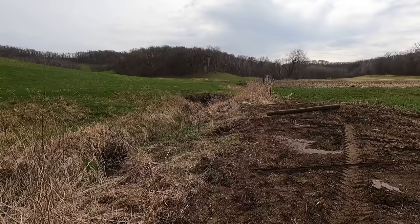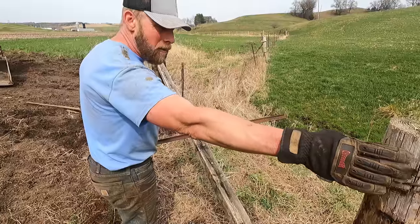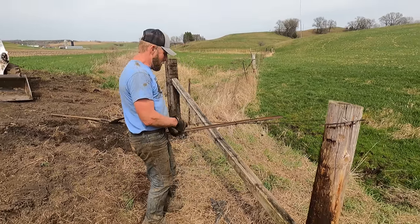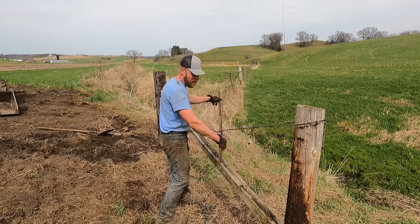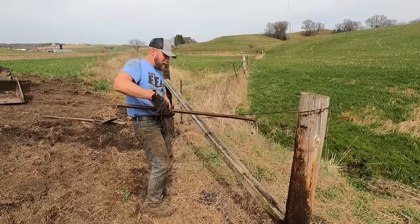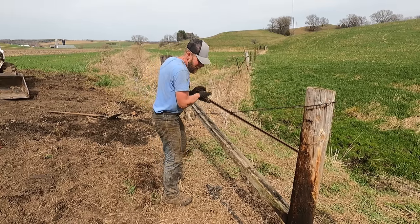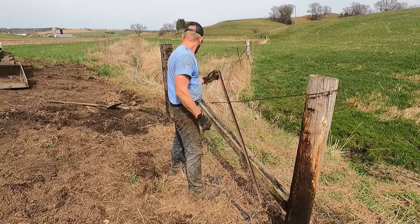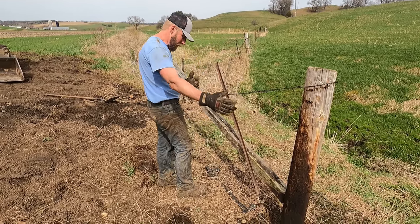That will allow us to make this operation go quite a bit faster. What we got here is a wire that goes off the top of our second post, around the bottom of our first, and then back up — we tie it together. Then we usually use a broken-off T-post, or you can use any piece of branch from the woods, because this helps stabilize everything until you get all your wires on and until your fence kind of settles in, mostly the first few years. Now that's tight, so that post can't tip. Everything is going up against the dirt.